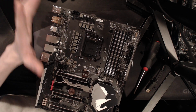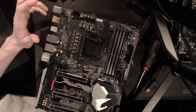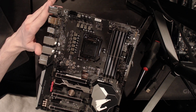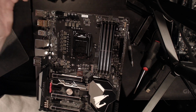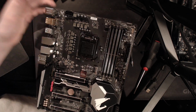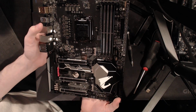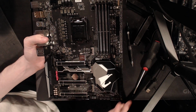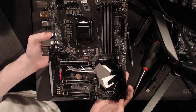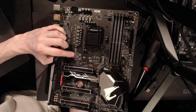The impact of these, I'd say, is probably very marginal in terms of what they do for your overclocking, but it is a nice touch in a way, because more overkill is more better. So you can't really complain that they're putting more input filtering on each of the VRMs. Now, anyway, back to the VCCSA and VCCIO.